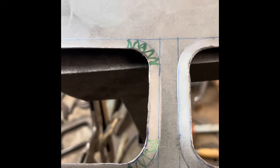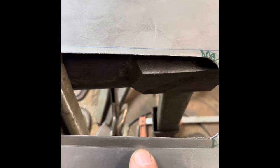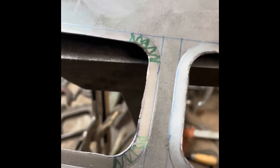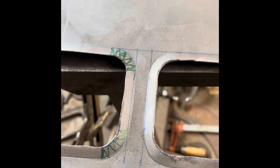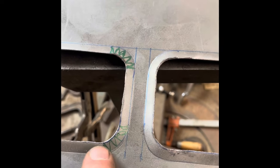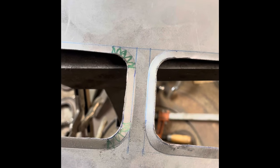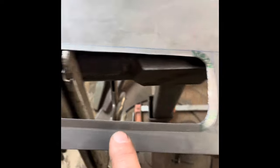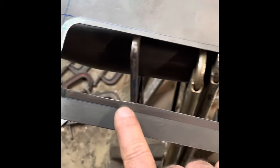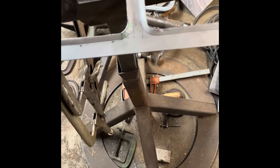What I've done here is highlighted that all the straights are simply a change in form — or what you could call a change in arrangement. Where I've highlighted in green, in all the corners, it needs a change in shape, or what you would call a change in area, because there's not enough material on this outside edge for that to turn up to 90 degrees. That's the limiting factor holding it back. Shape always takes precedence over form, so we're going to stretch those corners and then just change the form of the long straight edges and the short straight edge. To do that we're going to use several different hammers.